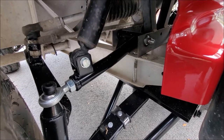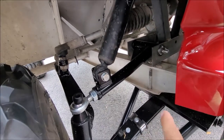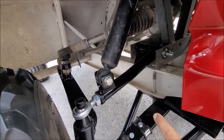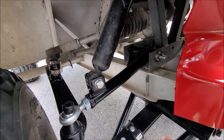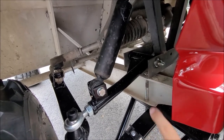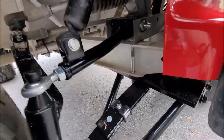On those four main bolts, from the factory they come with the bolts going up and the nuts on the top. I had to turn them around and have them face down. Then I used a die — a 3/8-16 die — to tap the threads an additional 2¼ inches in order for the bolts to clamp down.